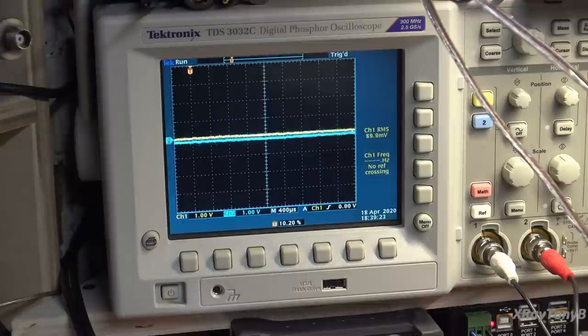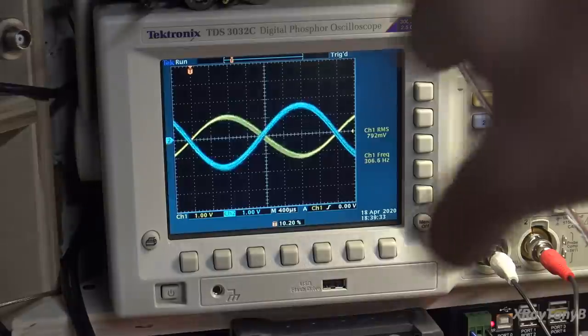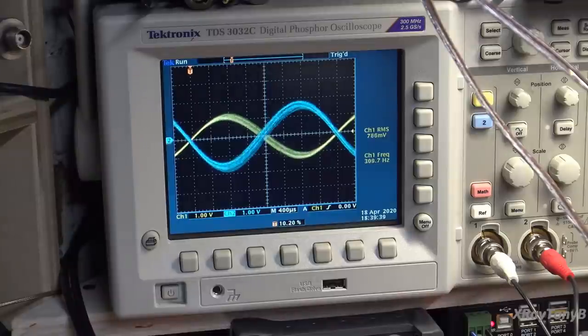And you can see, here it comes, and you can hear it. It's just an out of phase tone, you know, for between right and left. And you can see how those sine waves are kind of vibrating a little bit. That's actually the rumble of the record that you're seeing. That's exactly what that is.